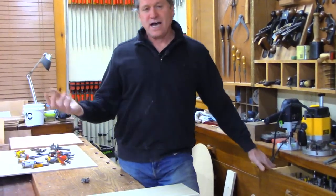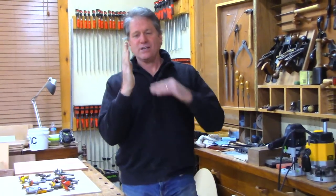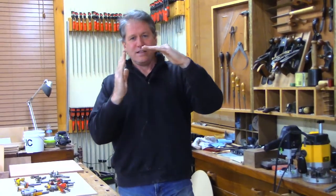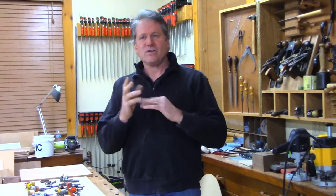I think it comes with a diagram, but it's a miter with a little tooth lock. You run one piece horizontally, and the second piece goes vertically, and when you put them together, they come together like a puzzle piece on the miter. It's pretty sweet. You get a stronger miter that way, but whenever I'm doing that, I have multiple test pieces just to make sure, because you have to get that height just right. And I think once you get it dialed in, it's pretty good.